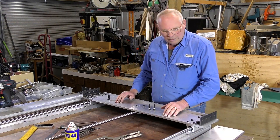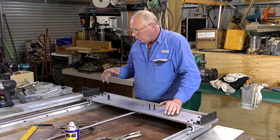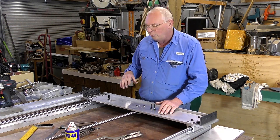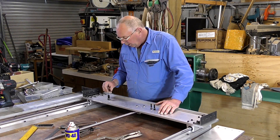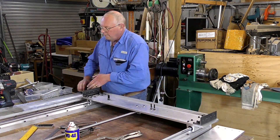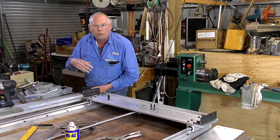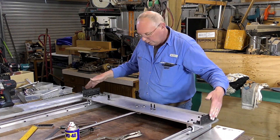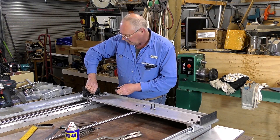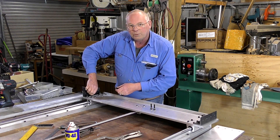I've got some sub-assembly now of the gantry. I don't know whether I'm going to be able to totally finish the X-axis in this video because I'm trying to keep the videos below 12 minutes each. But I've got all my brackets now drilled and in place. This is the actual gantry — it's starting to get a little heavy. That's the X-axis cross member there, and I've got my side plates and the bracketry. We'll put these on and start building this gantry up — I'll speed some of the footage up here.